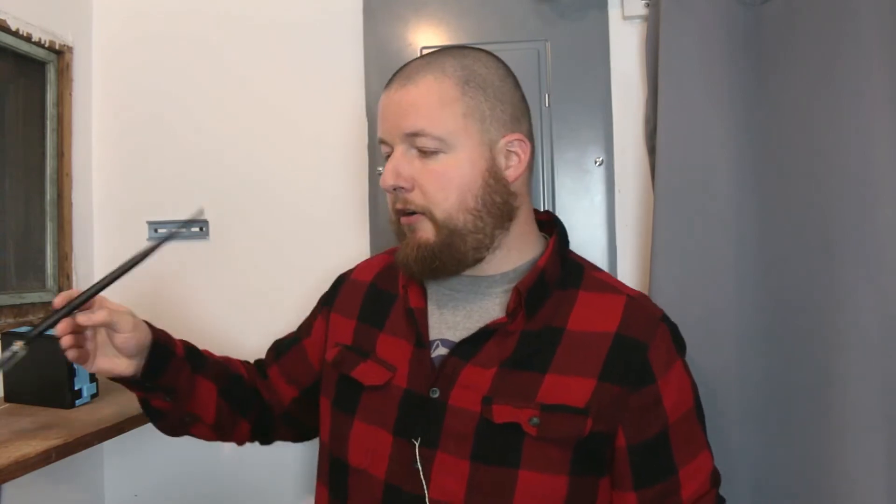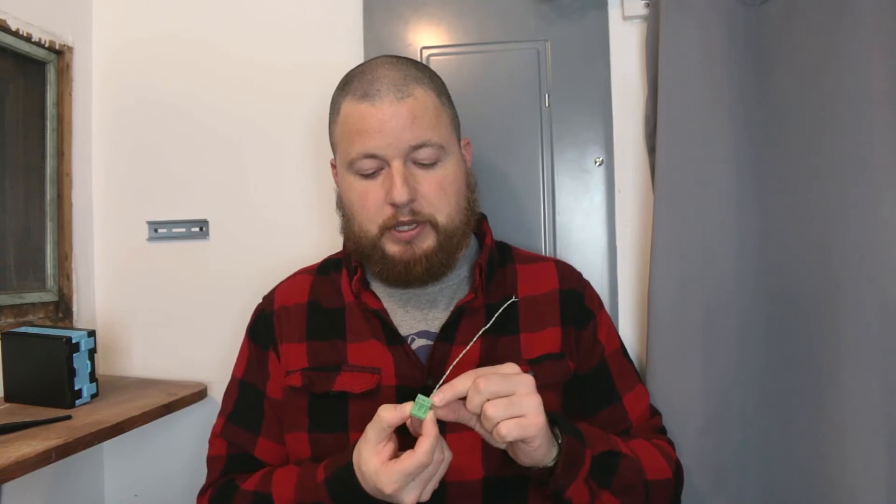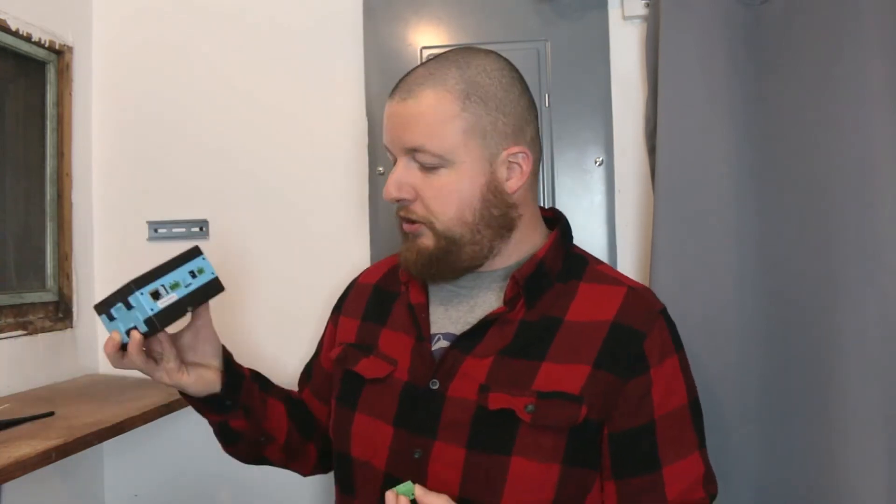The Push 3 is going to be hooked up to an antenna to receive data from our Omnimeter, and it will take that data and push it to the cloud. To set this up, the first thing we're going to do is set up our antenna — it's the exact same one we used in the garage with the same port. We're going to use a twisted pair again and tap into the A and B port. They have a three-pronged terminal that we can put our twisted pair into. We're going to use solid green in A and white in B, using the same terminal configuration as our other antenna. There's only one three-pronged plug it will fit into — that's how we hook the antenna into our Push 3.